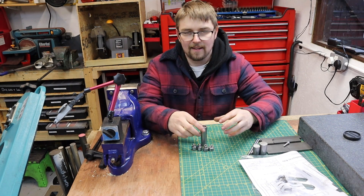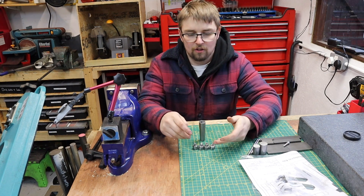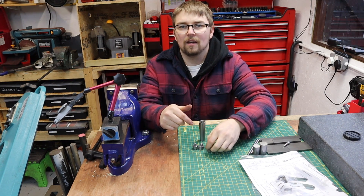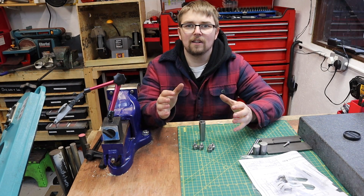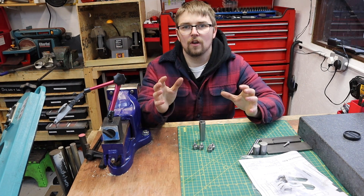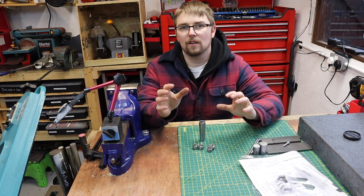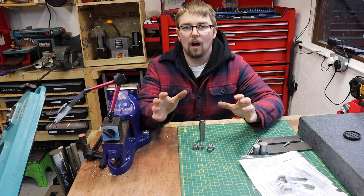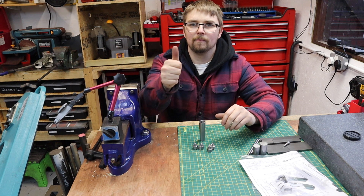There we have it — the rotary table fixture is all completed. I've gone with one Morse Taper 3 insert tooling and to start I've got four different inserts: 6, 8, 10 and 12mm. Anything over 12mm I'll put a through hole in to bolt it down into the taper. That wraps up today's video and leads nicely into the next one where I'll be cracking on with the knurling tool from Hemingway Kits. Sorry for the delays between videos — lots going on over Christmas and New Year. Thanks for watching, please give it a thumbs up and subscribe if you haven't already!